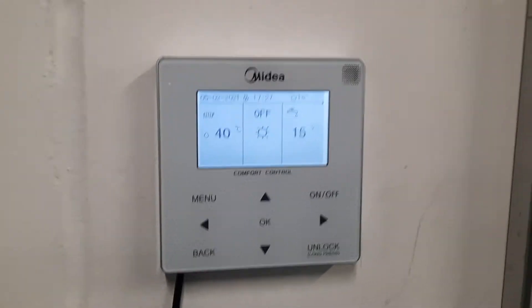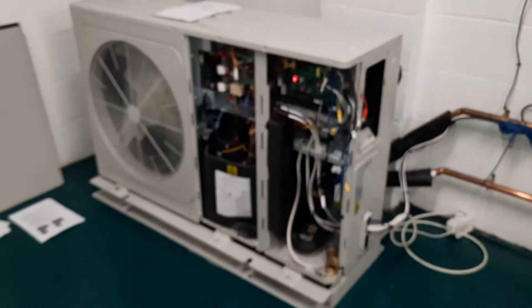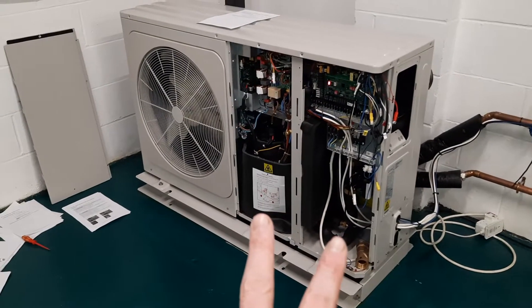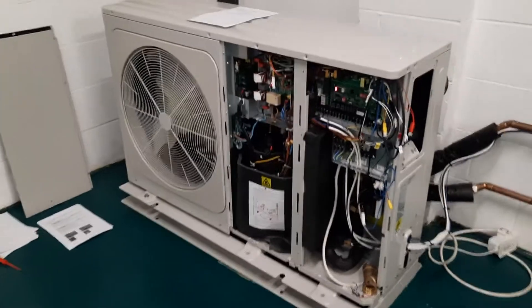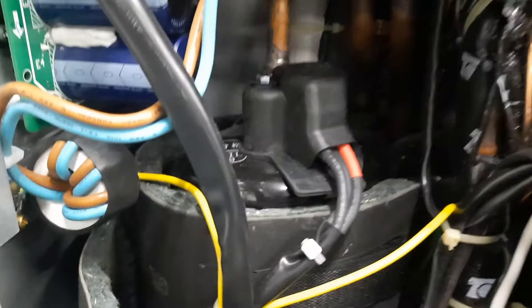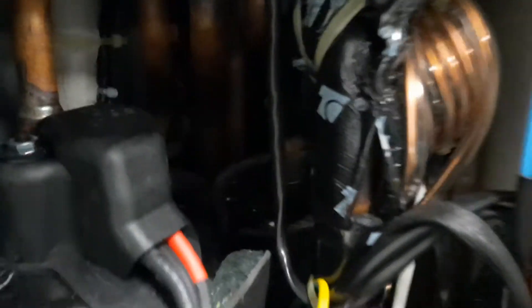If we go to the outdoor unit, I'll show you what's been going on. If you whip off the two covers of the unit, you can see your middle and your right-hand cover. We need to get into this cover here to see the compressor. If you look at every compressor ever made, you will see that there are essentially two pipes going into them. We have our small one at the top here, which is our outlet — it's always coming out the middle of the compressor — and our suction is over here in the background, a much, much bigger pipe, hidden away.